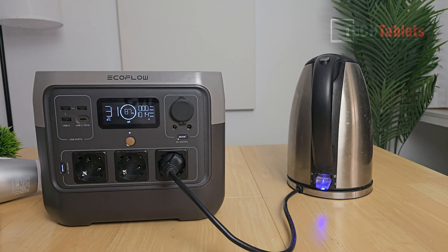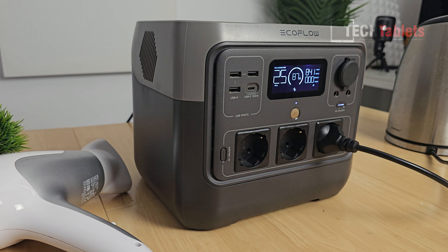It went for about 30 seconds before the overload tripped and turned off. You could repeatedly cycle it to eventually boil water, but it's not recommended since you're exceeding 800 watts. I then tested charging at 840 watts while simultaneously running a load — it tripped immediately, stopping both charging and discharging. It doesn't handle loads over 1000 watts while charging at around 840 watts simultaneously.